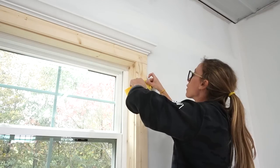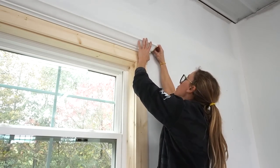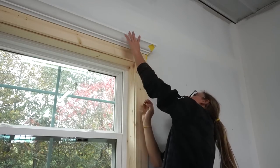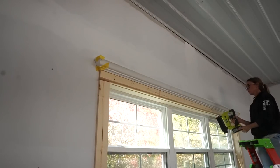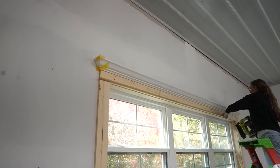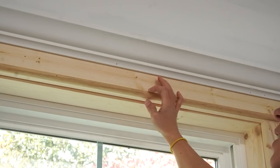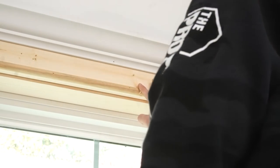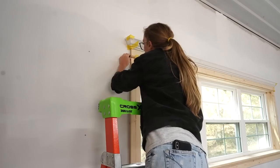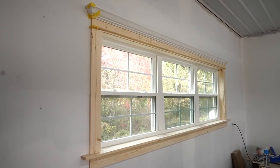For the end caps, I like to rip off a couple pieces of painter's tape and have them handy — I apply some glue and tape these in place on the ends until the glue dries. I nail the half round molding along the bottom edge of the top 1x4, again using the 18 gauge nailer as the smaller nails are better on these delicate pieces. I've only ever found these in eight foot pieces and since my window was so long, I ended up having to splice them together in the middle. I cut a 45 degree angle one way on one piece and the opposite way on the other, so when I put them together I can just putty over that seam and you'll never know. I added a little dab of glue there too to glue them together. The end caps of the half round molding are attached the same way as the crown — one square end and one 45 degree end, three quarter inches long, simply glued and taped in place.